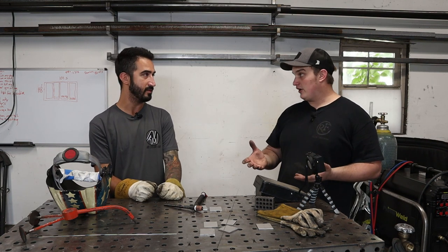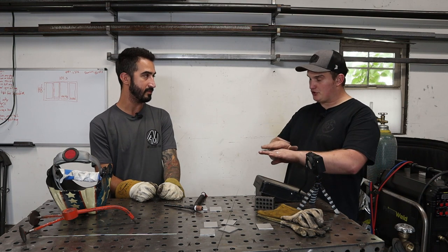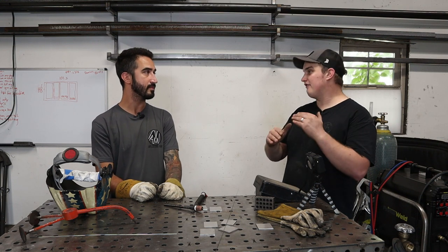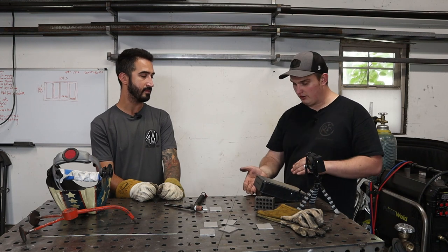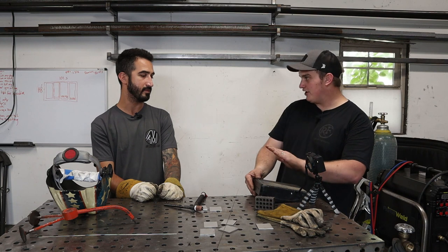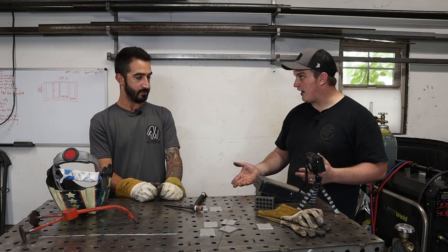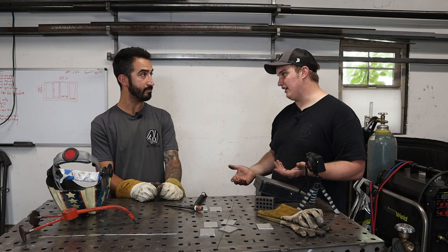The downside that comes with a lot of newer people welding is that it affects the sweet spot. When you're welding, that perfect amperage or that perfect weld is going to be within like a 5 amp range, 5 to 10 amps. So the broader you have that range, the more minute movement is going to affect that. Till you feel it out, we'll start out with 120 max. And since this is stainless, you're going to be using less than that anyway.